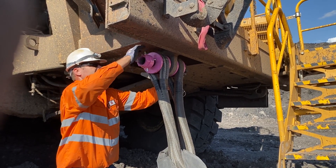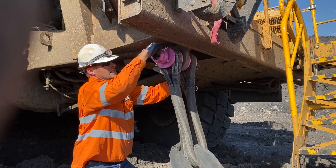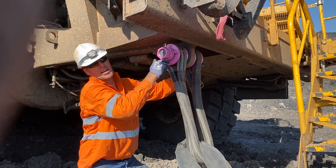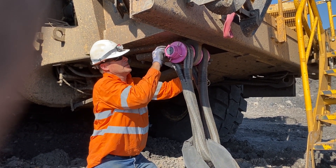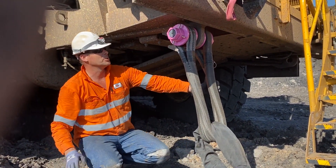Do the nut up. Once you get the nut up tight, it pulls up tight — back it off half a turn. There you've got your sling on your soft shackle, ready for pull.